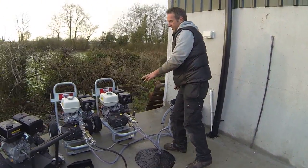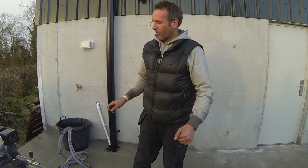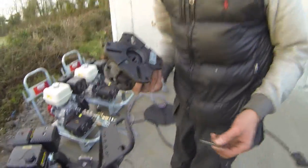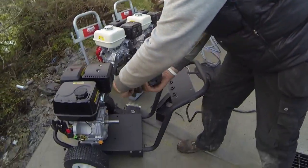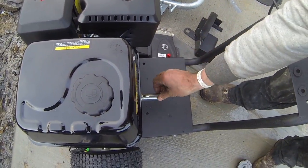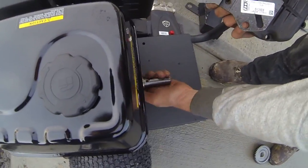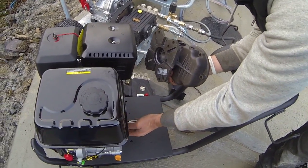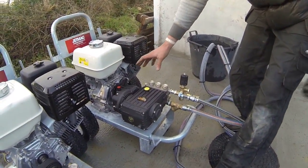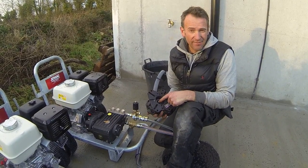The gearbox system is a good system. Everybody on the internet says you must have a reduction gearbox, and yes, it's very important. But the problem with the reduction gearbox is that once it's built and fitted and this key is set on the shaft, every time you pull the trigger on your gun there's a certain amount of snatch on this key within the shaft — a lot of wear, a lot of heat coming from the shaft passing through the whole pump, and a lot of vibration from the engine passing through the shaft. Two or three years down the line, if you ever go to take that pump off, the chances are it's probably welded itself onto the shaft with rust.